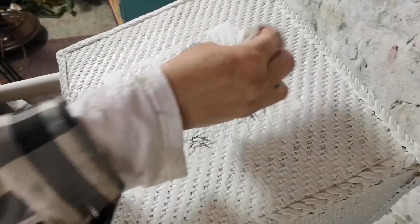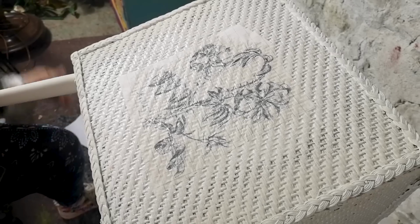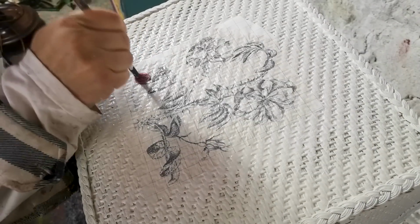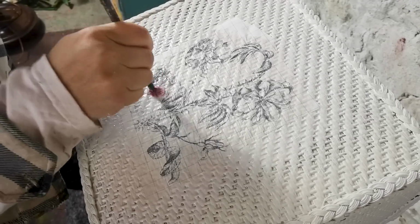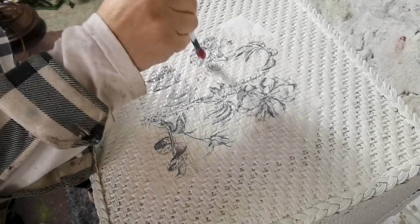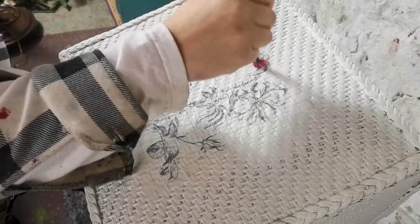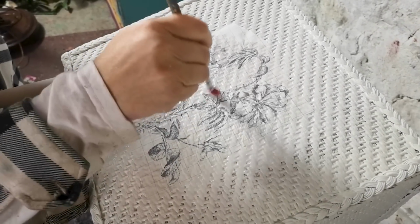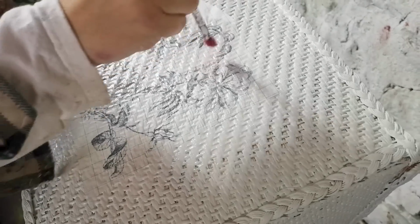So I'm not scared of using inlays, and I don't know why people are so scared. I think it's maybe because, and I've got to admit, I've done this. Once I'd done inlays a few times and I'd had really good results, one night I came over to the shed to finish a piece, and I didn't have my glasses on, and it was the Giselle Toile. It's a very pale bird white sort of inlay, and I applied a whole row on a dresser the wrong way around. I was applying the checked part, and I painted over the actual inlay. And once you've done that, your inlay's ruined. There's no way of fixing it. So always be really careful that you're putting the paint side down.